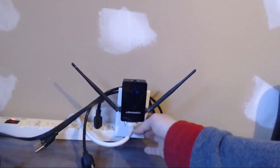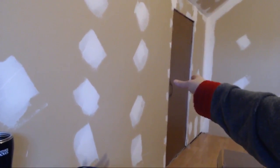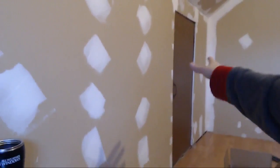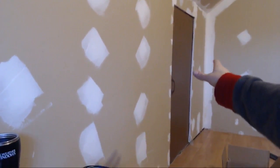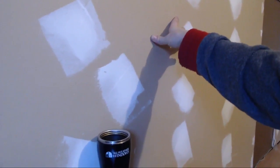When I expand I'll either run other devices by Wi-Fi or pick up a network switch. As far as power, I only have one circuit in this room right now. That door over there is access to my attic space, and straight down that side of the house is directly down to my power panel. I'm going to run a heavy cable from there and put an extra sub-panel right here on the wall so I can run short circuits off it. I'll run a 40 amp, 220 volt connection up here — that gives me 80 amps at 110 volts — so I'll likely be able to run six circuits, giving me lots of power for the full mining room build-out.